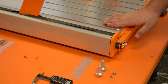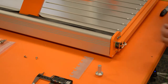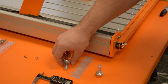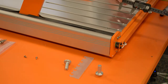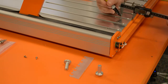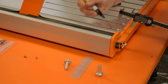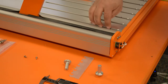The first step — we're at the back left of the machine by our Y limit switch. We're going to take our two M6 nuts, slide them in the first channel, skip one channel, and slide them in the third channel. The manual recommends you space 38 millimeters — about an inch and a half — from the back of the machine. I have my caliper here and I'll make a little mark on each channel where we'll place our M6 nuts.